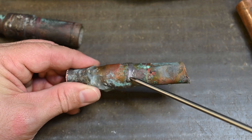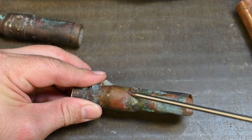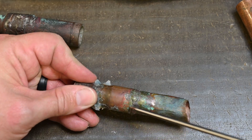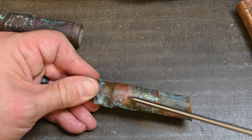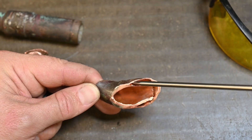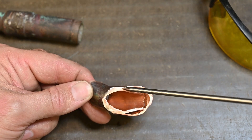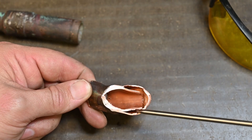If we take a look at this one — this is nice because they have it really smooth. See how smooth it is from one side to the other? It's like an on-ramp. I really like it all the way around. But the problem is it doesn't look like they pulled it in very deep at all — it's really shallow. So as nice as that looks, it's irrelevant because it wasn't truly brazed; it wasn't pulled up into the joint. Once we cut this open, here's our braze connection and the end of that joint. All the way up in here there's nothing — it was able to pull away right there, not a drop of brazing rod at all. It's only held right here at the connection. While it looked really good, there's a really poor braze — nothing holding it together.